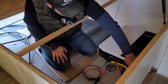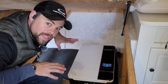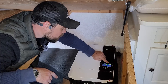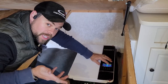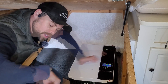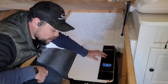Initial startup — all right, just like that, we have power. So I'm now powering the entire RV. Just heard the microwave kick on. It's showing 120 volts and 0.4 to 0.5% of the load. The way you read that: you have a 3,000-watt output, so 1% would be 30 watts — at 0.5% that's basically a 15-watt load. It is almost six o'clock at night, and this whole thing from beginning to end took me less than an hour. Actually, filming took more time than the actual work of putting this in.